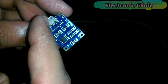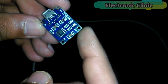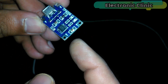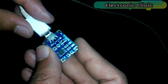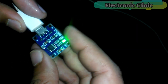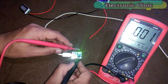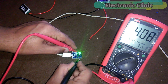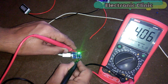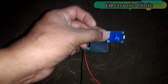The red LED indicates charging while the blue LED indicates the battery is fully charged. We can connect a cell phone charger here. The module has battery plus and battery minus contacts which will be connected with the power bank. I connected a cell phone charger to check the voltage — as you can see, the voltage is greater than 4 volts, which is best for charging the power bank. Now fix the voltage indicator and battery charger on the veroboard.